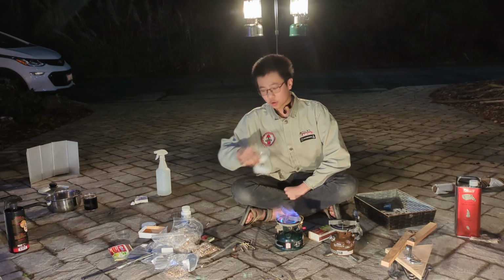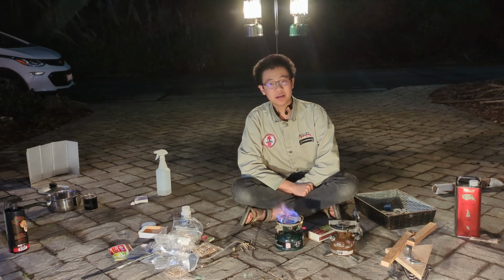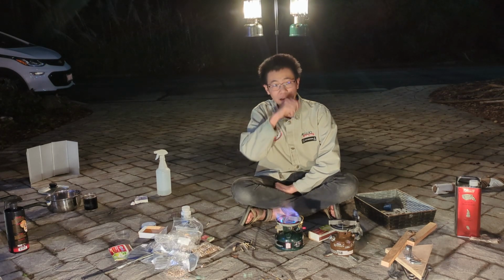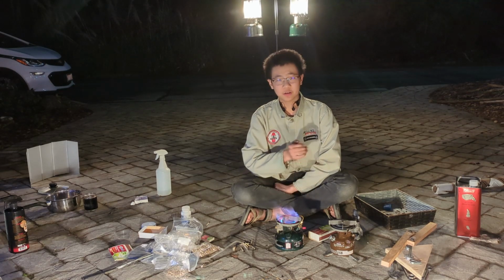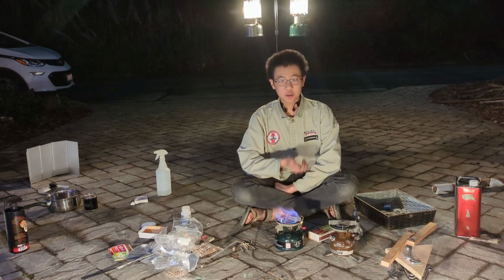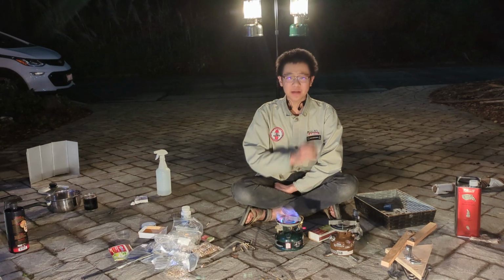It is also more serviceable. With a graphite packing, if you ever need to service the part for any reason, you have to carefully pick out the entire packing without damaging the threads or something around it, and you've destroyed the packing. Or you might pull it out, and if you get lucky, you might be able to save it, but probably you won't be able to.